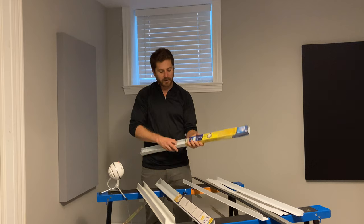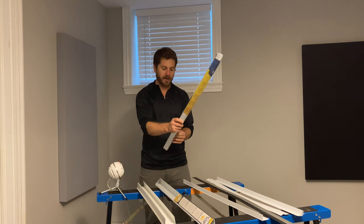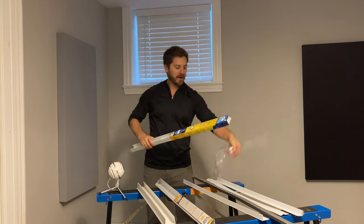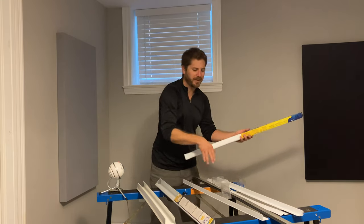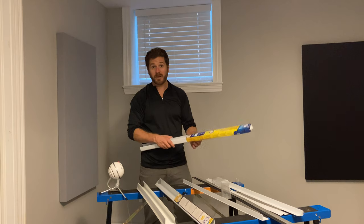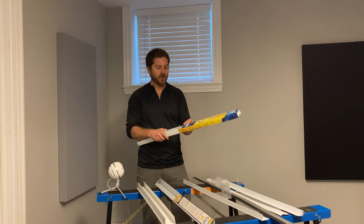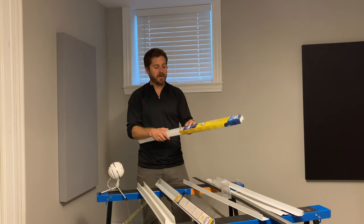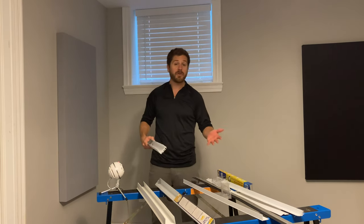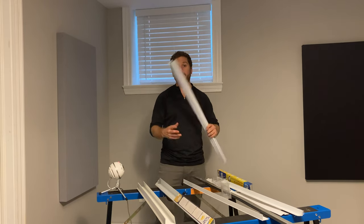So make sure that a door sweep inside the house is only used when you truly need soundproofing, and don't keep the door always closed — that's not good for airflow. The two door sweeps I recommend for an exterior metal door are the U-shaped ones. Between paying $5 for something that doesn't work versus $15 for something that actually works, $15 is the better compromise. You'll need a drill for a metal door, and it's better to pre-drill holes.